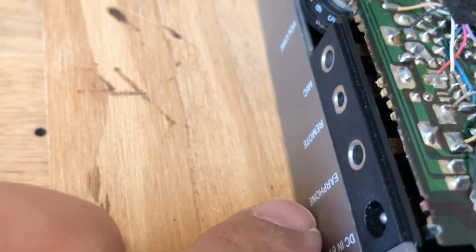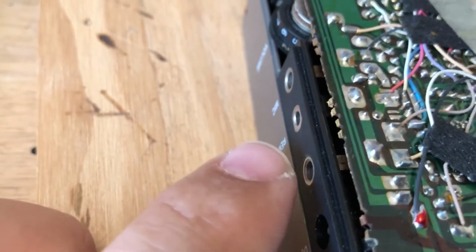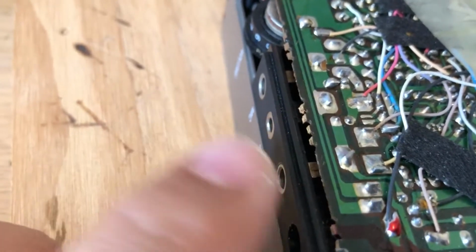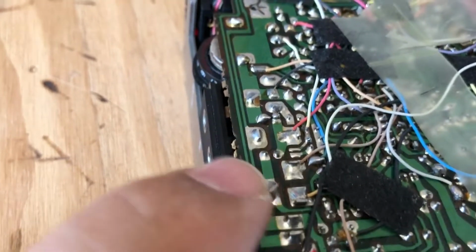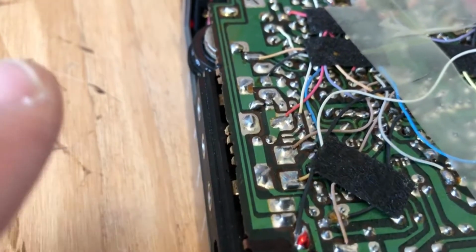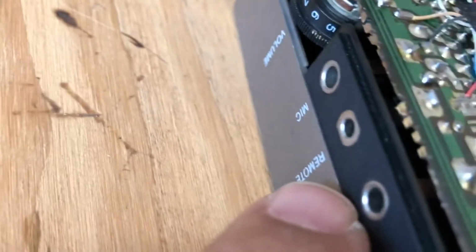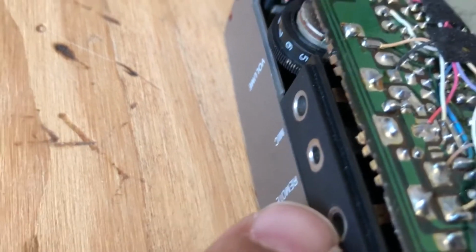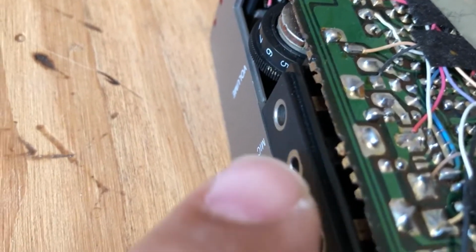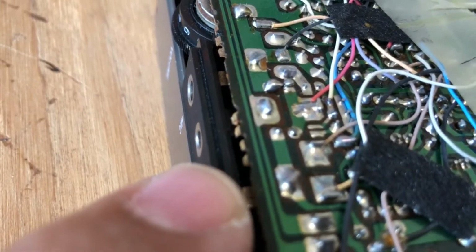So unfortunately, the earphones only half work. I was fiddling around with it, trying to see if I can get the jack to go in correctly. My only way of fixing this is to desolder the jack itself and see if I can install a different jack, which totally can be done. I mean, I don't see why not. And these probably sell the jacks online. It wouldn't be original anymore because I would have to remove the old jack and put in a new jack. I could also troubleshoot the jack once I detach it from where it's at.